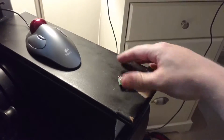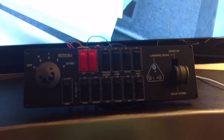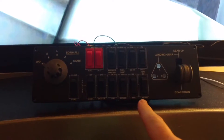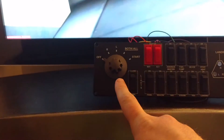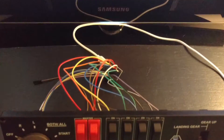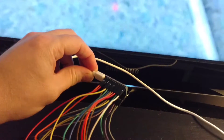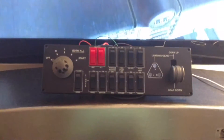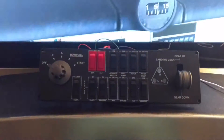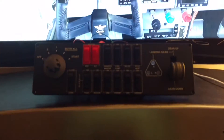So I took it apart — this is the circuit board for the little switch panel. Essentially it's a bunch of switches: the power and system switches along with all the light switches. This is a two-position switch and this is a five-position switch. I went ahead and changed all the wiring and put it into an Arduino Pro Micro, which is based off the Leonardo and can do USB HID. This allows me to send keyboard commands, so I can remap every single one of these buttons.